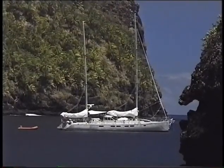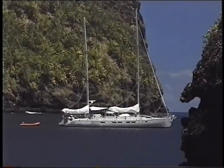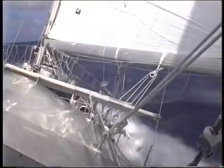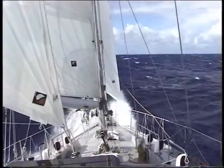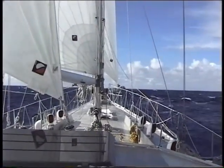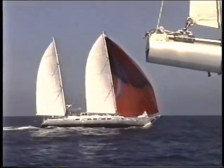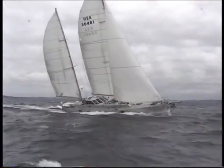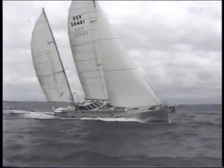Beowulf is a development of the 46 yachts which have come before her. We've learned that modest beam, balanced hull lines, fin keels, and spade rudders go together to create easily driven and easily steered designs. These are critical issues in any offshore vessel. The proportions of her ketch rig, with two almost evenly sized and widely spaced spars, are based on many thousands of miles of offshore testing.